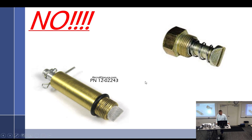All right, so put the magneto where it's supposed to fire. If it's a Bendix, you put the red tooth in it. So for you people that are doing the mags on the Continental, it's all right. Put it top dead center number one. You put it top dead center number one. I just walk by and look right in the window like that and see if I see a red tooth. If I don't, I know you screwed up. You should verify that. Double check your work.